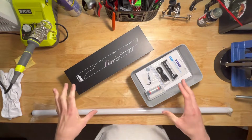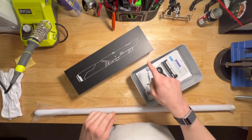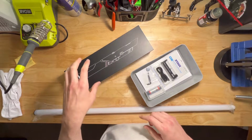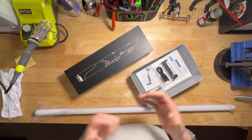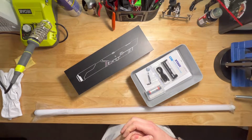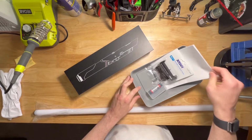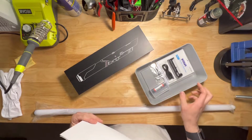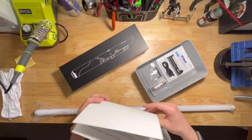It is a Neopixel setup, so we got a Neopixel blade, and we have a Neopixel connector on the inside of it, and it is using a Proffieboard version 2.2 with the latest operating system 6.7 and FET263's prop file for his 2-button setup. So first I'm going to go over what comes with the lightsaber.